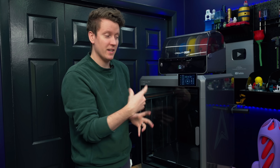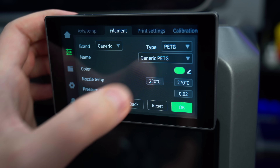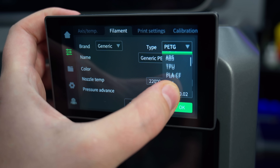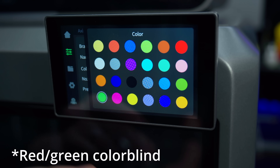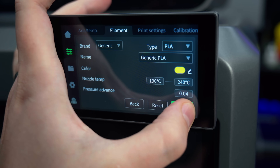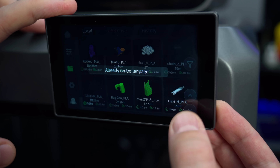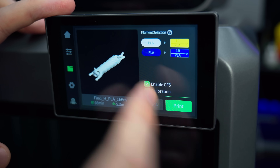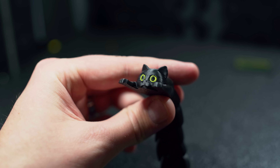On the screen you can tell it exactly what filament you just loaded. Click on settings, filament — it's filament number three we just changed out. You can change it; it's Creality brand or generic are your two options. You can also change color, though I don't love this screen — I'm colorblind and I wish there were labels or a color wheel. Hit OK and now it has loaded in the new filament. Then I can go to print files, select the model, and that's just how easy it is to change filaments and start a print.